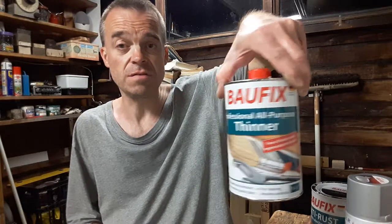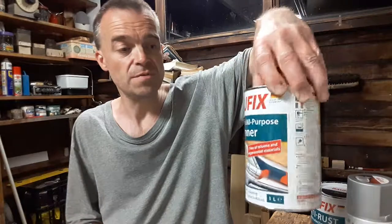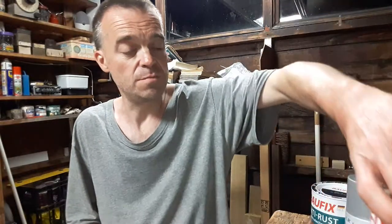I'll brush it out and let it dry, see what it looks like in the morning. I'll probably give it another coat of this black — it should cover up all right. That's just a little bit of information: if you've spray painted a metal item with that aluminium zinc primer, don't paint this over the top because it softens up the primer. Also, you need thinners to clean the brushes out — bought that today, it's pretty good for cleaning your brushes out, white spirit's not very good. That's $2.99 for one litre. Give it another coat and see what it looks like. See you on the next one.